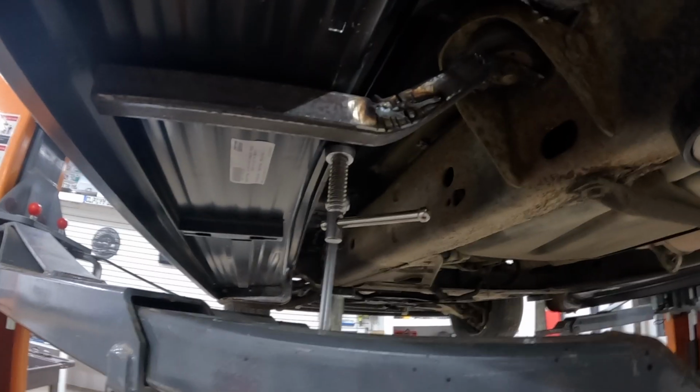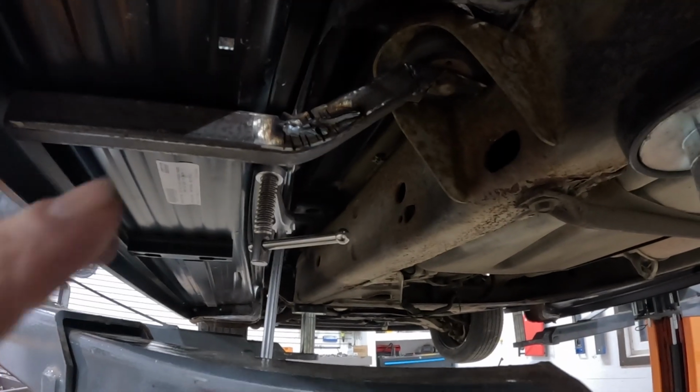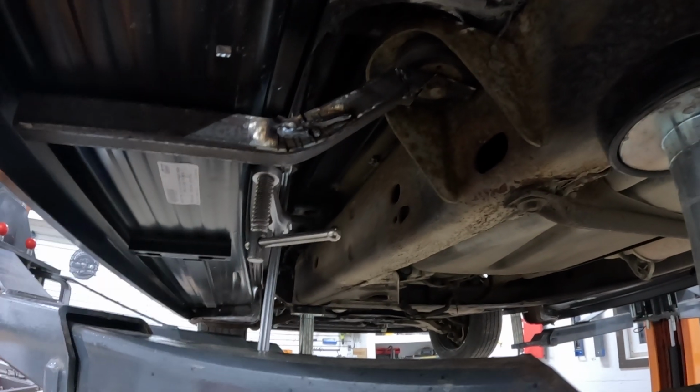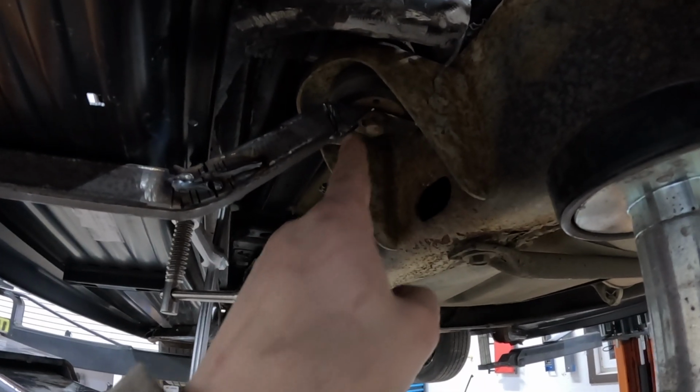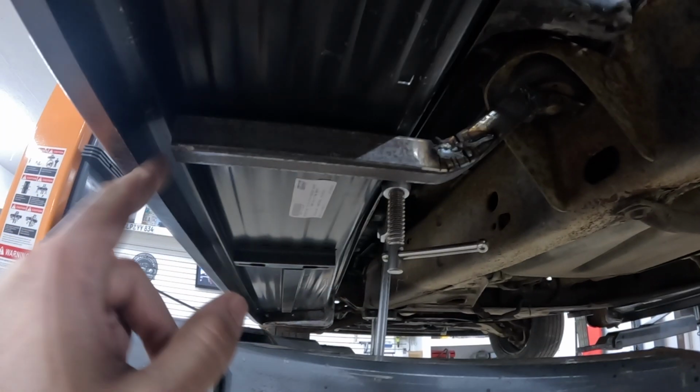Okay, this is where we're at. I mean, if you could see the welds, I don't know if it's too dark under here. Don't worry about them. I just kind of ran a quick bead to close up the pie cuts. So we came off the flat down to, I don't even know what degree that is, almost a 45, back down to another flat.